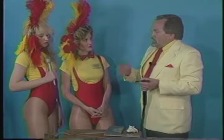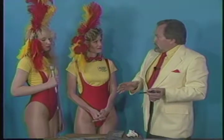And what I'm getting at is that a sharp welder really has to know these things. That's why I always recommend, again, when people start learning how to weld, please do oxyacetylene. Don't cheat yourself, because you can see so many things in that slow developing puddle, and it makes a great weld, and it's the most versatile of all welding. You use it for everything, and you learn about metal. You learn what to look for.